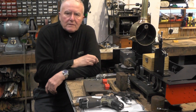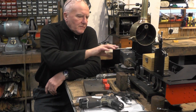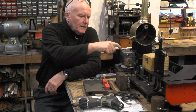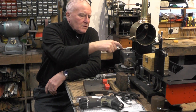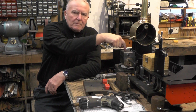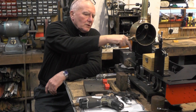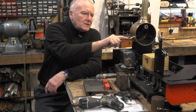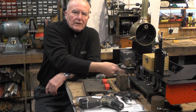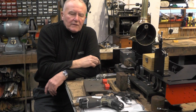Okay, that's the bulk of the cylinders' external work done. There's just a few odds and ends to tie up — like I mentioned earlier: 20 studs to make, 20 domed headed nuts, the banjo for the lubricator, the manifold holes in the steam chest for the steam pipe, and the automatic drain cock holes underneath the cylinders.